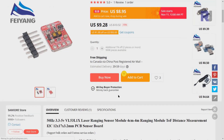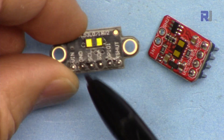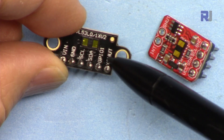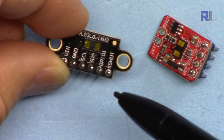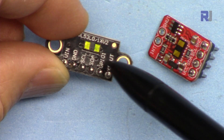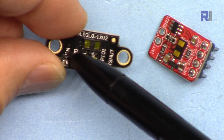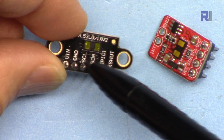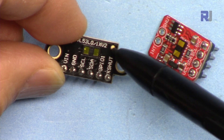New from ST Semiconductor, they use I2C communication — two wires in both cases. Here we have GPIO, this is the interrupt pin, and this is X-SHUT — this is to shut it down. In some cases you want to shut this down and only turn it on when you need it to measure. For our continuous application, we will use VCC at 3.3 or up to 5 volts, ground, and then SDA and SCL for I2C communication.